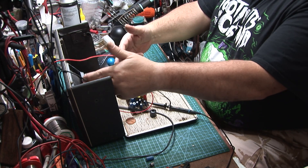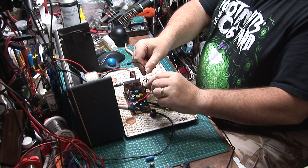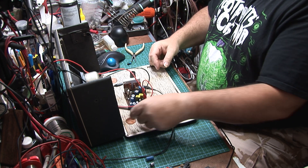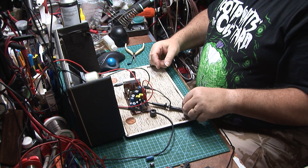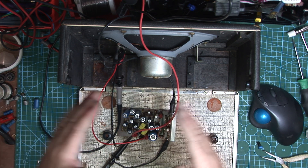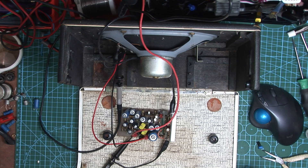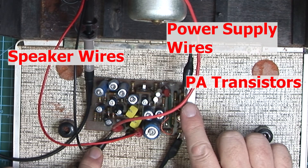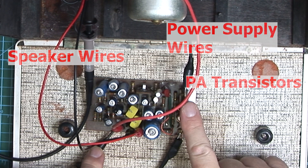What we have is the input voltage, we have the wires connected to the speaker, this is the oscilloscope probe going to the oscilloscope, and this is the audio coming in from the audio generator. I've got the speaker in line so that you can hear everything. Normally you wouldn't worry about doing this. According to the manual, 26 millivolts of input should give a nice clean signal out at about a watt.